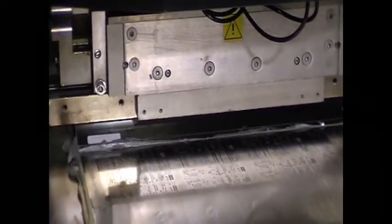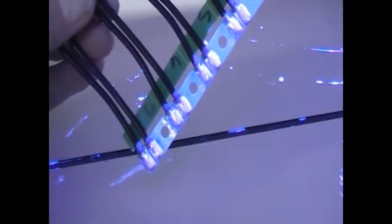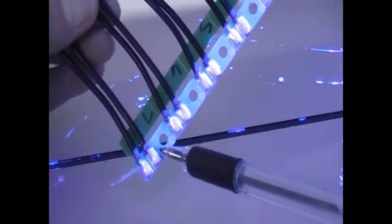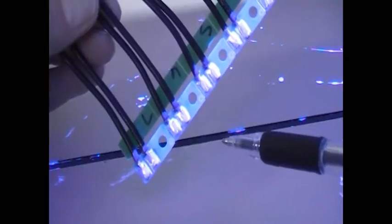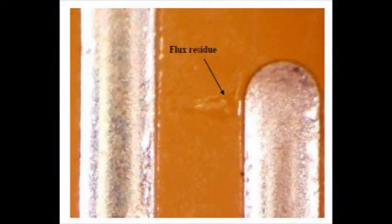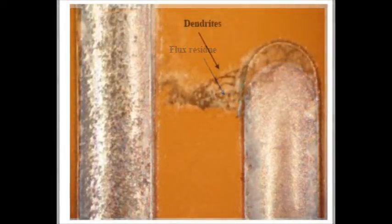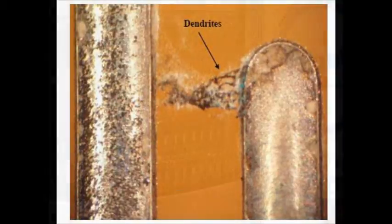But there are still some cases where customers will want to use water-soluble flux, particularly when a conformal coating will be used on the finished board assembly. The residue from the no-clean flux can chip off and leave gaps in your conformal coating, which defeats its purpose. The downside of water-soluble flux is that the flux residue remains corrosive after reflow and contains ions that can lead to electrical shorts months or years later, so it has to be washed off.